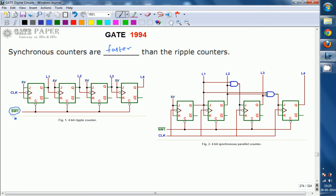All the flip flops will be cleared asynchronously with that input. We are only interested in the clock. This is the original clock, and it is connected to the LSB flip flop. The next flip flop is clocked from the output of the LSB flip flop. In ripple counters, the original clock is given only to the LSB flip flop, and all other flip flops get their clock from the previous stage output, which acts as the clock for the next stage.